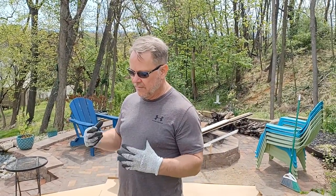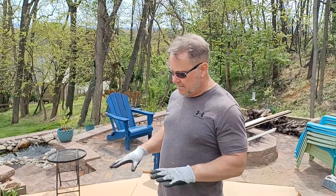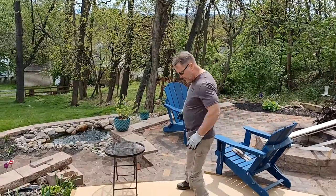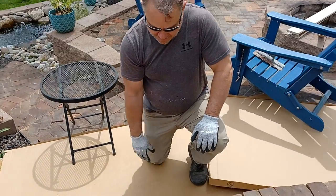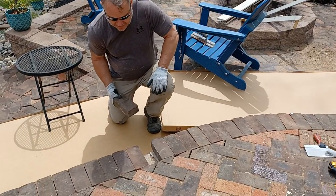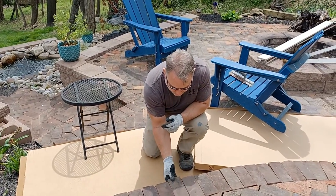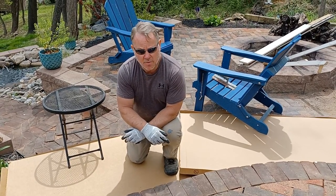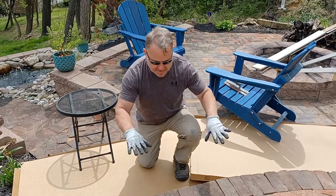Normally a brick patio or a flagstone patio will be laid on a bed of sand that is tamped very tight. And sometimes they're not maintenance free. Especially on the edge, like on this brick — the brick sticks out about two inches beyond the base of the brick patio. So what we've done is we've taken all the bricks loose — they were glued down originally. We've cleaned the brick up and now we're going to use a thin bed mortar, a thin bed grout, set like you would use for ceramic tile to give it a much more permanent bond and to help support the rest of the brick from shifting.